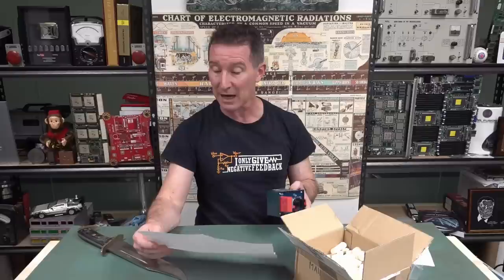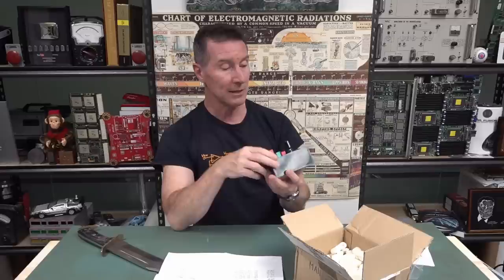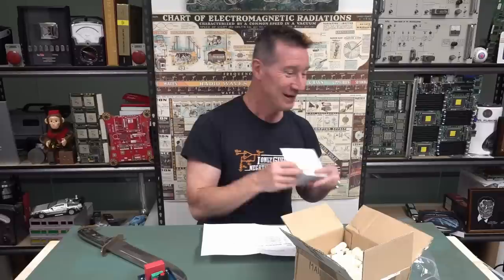I assume that's a serious LCR meter with much better tolerance. As a rule of thumb, when doing calibration you generally want an order of magnitude better accuracy than the device under test. In the ultra high end metrology world you might only get a couple of times better. Cool - we've got a knob on there and reference caps. That'll be handy for testing multimeters. And apparently it sells astonishingly well considering the very limited market. People are obsessed with calibrating their multimeters and having standards to check against them.